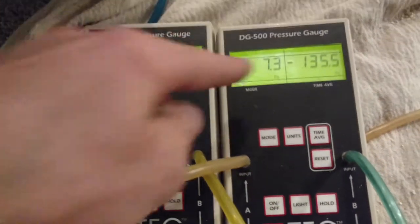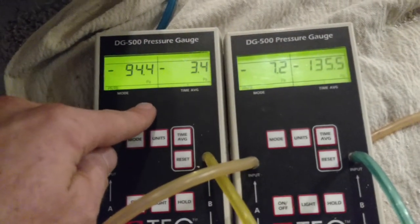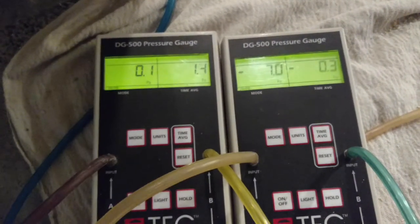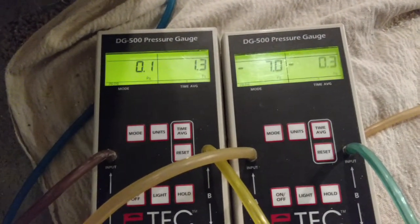The key to getting your levels low is to get negative numbers — suction — under the entire home. You'll see if I close this valve, these numbers will instantly go positive, which means now we have radon coming in in that section of the home.